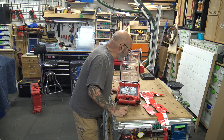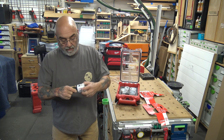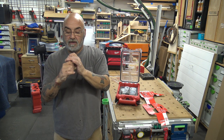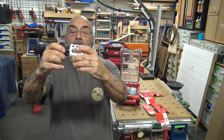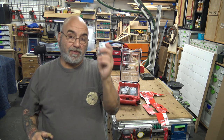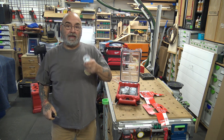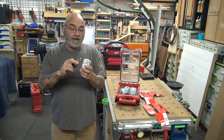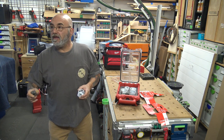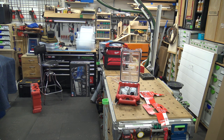It's got two, two-and-an-eighth, two-and-a-half, two-and-three-quarters, and a three-inch hole saw. You screw it on — don't screw it all the way down — look inside until you see the holes line up, push it up and it's locked in. You don't want to push it all the way down so you can still pull it out and unscrew it to clean it. The beauty of it — these have the vented holes that bring the heat down a little bit, and also give you a nice place to pull the core out.